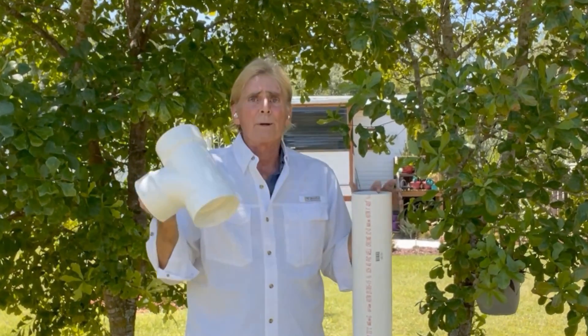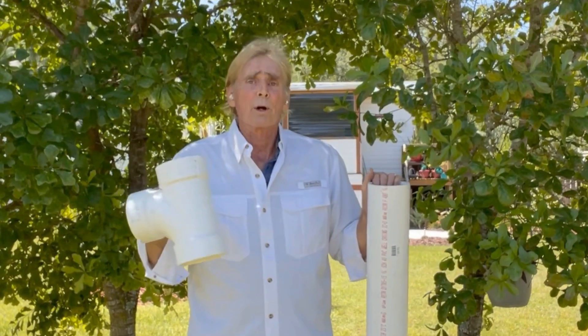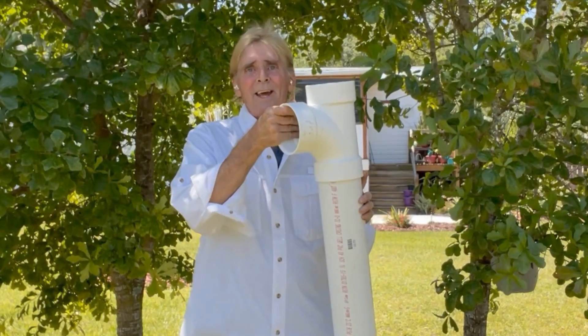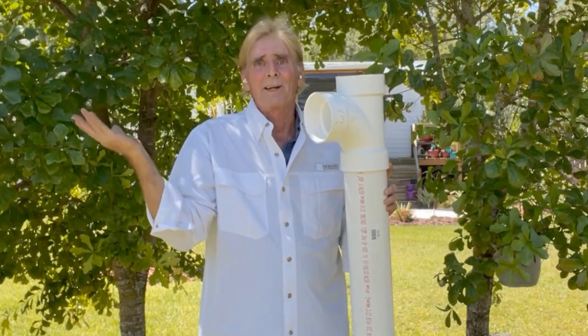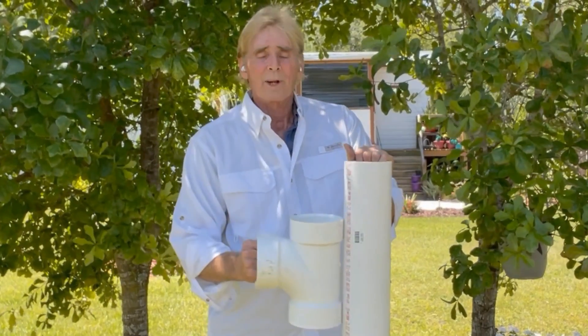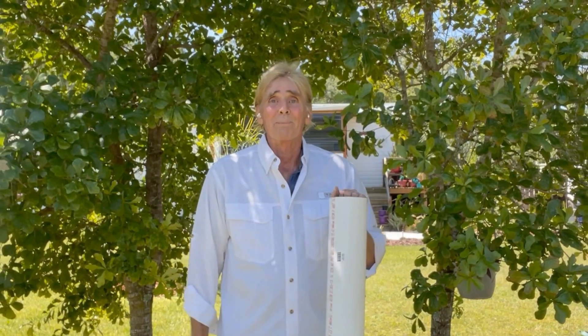You've just installed a really great system — great material, works great, no problems. But let's say you want to attach a downspout drain, a yard drain, or a catch basin to this existing system. Sounds easy enough: snap it together, put more pipe in, cover it up, right? Well, remember, this is down in the ground and we're going to need to cut this pipe and fit a fitting onto the Schedule 40 PVC. A little bit more difficult than you might think. Let me give you a couple of pointers and tips. I hope they help you if you decide to add to your existing system with Schedule 40 PVC.